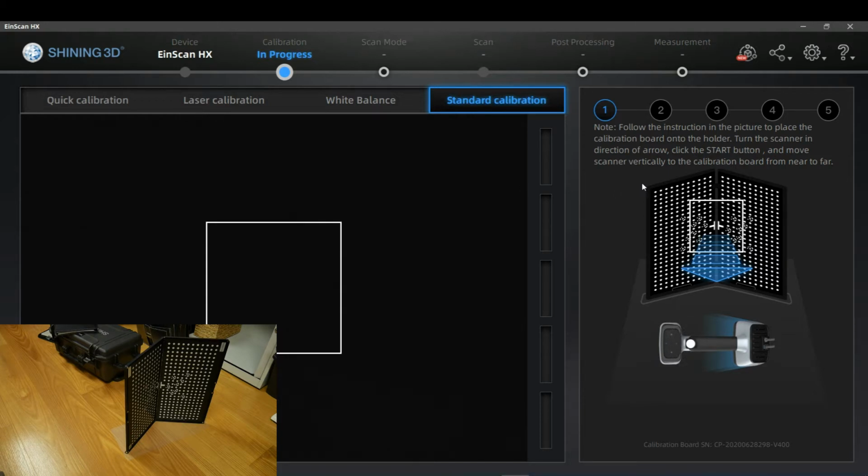most of the people are doing scanner calibration, putting that board on the desk. I'm doing it a bit different. It's my preferred version. There is no right or no wrong, as long as you're doing it like it is mentioned here in the sketch, that relative positioning from the scanner to the board. I'm doing it because I like to sit on some office chair that have rolls, and I'm going to just roll back to adjust the distance to the calibration board.